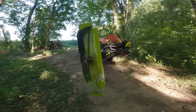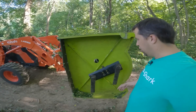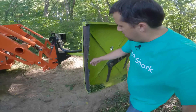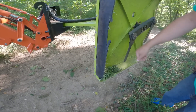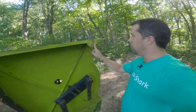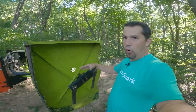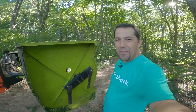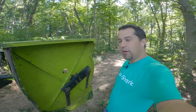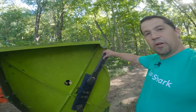There are a couple things to look at as far as the mower itself is concerned. Being able to tip it up like this is really nice — I tied up some twine in here earlier and it was a lot easier to clean out the underside of the mower with it vertical rather than climbing down underneath. I did beat up the rubber flap back here a bit by throwing some stuff out the back. The shoes on the bottom are made to be dragged across the ground — they get a little bigger up front as you're driving forward. I tend to run this thing dragging it backwards across the ground rather than pushing it forward on the ground. Anytime you have an implement that can be pulled by the tractor rather than pushed, you'll end up with a lot less wear and tear.